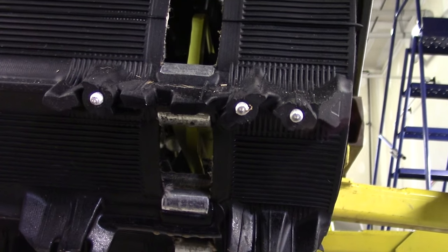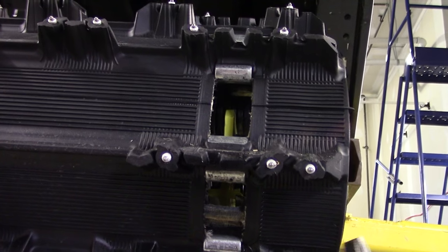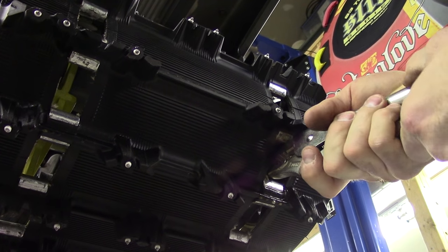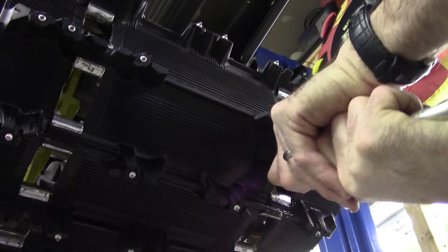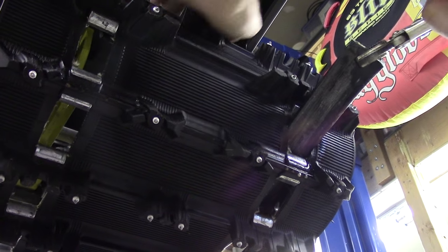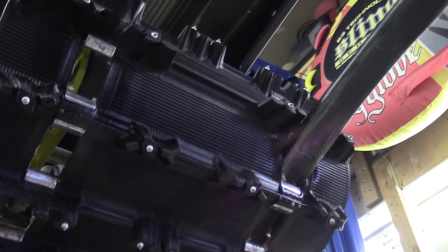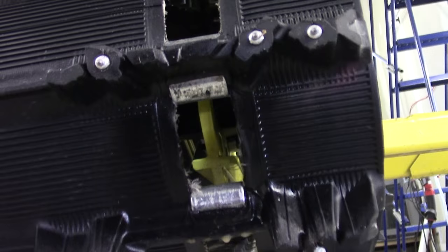Now we're going to take our pry tool and stick it into the side of the slide — you can do this with a screwdriver or anything sharp — and take your mallet and slowly bang the slide back. The slide itself is now seated into the opening, pressed tight against here, so we're going to take our vice grips and move it out of there. Get a good firm grip of the slide, twist it sideways, and give it a good yank. The slide has come through the opening — just keep on pulling. There you go, first slide is out. We're going to do the same to the other side.